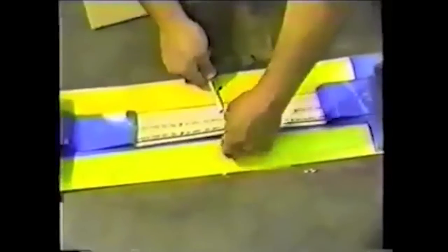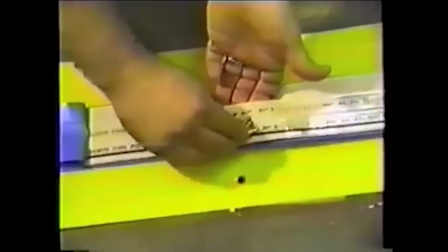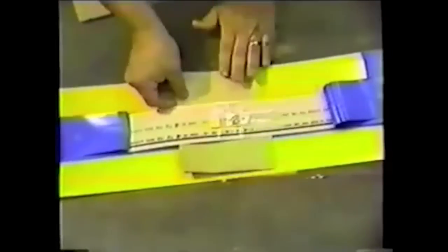After removal of the floor fitting, the remaining hole in the center ground conductor should be repaired. Separate the perforations on both sides of the cable's center conductor and install a splice connector over the hole in the center conductor. Terminate the splice connector using the Undercarpet Pro Crimper Tap and Splice hand tool. When installing the splice connector, center the hole in the cable between the splice connector legs. Install an insulator patch over the cable where the power cable fitting was removed.